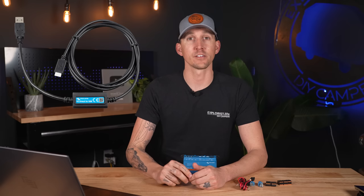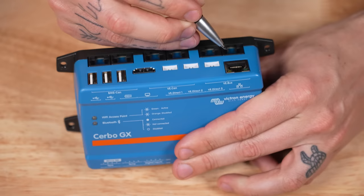DVCC gives us helpful features like the ability to limit total system charging current if, for example, we have more solar than our batteries are allowed to charge at. DVCC is pretty powerful and there's a whole chapter dedicated to it in the user manual. There are only three VE Direct ports on the Cerbo GX, but more can be added by using a VE Direct to USB interface cord with a USB hub connected to one of the USB ports.